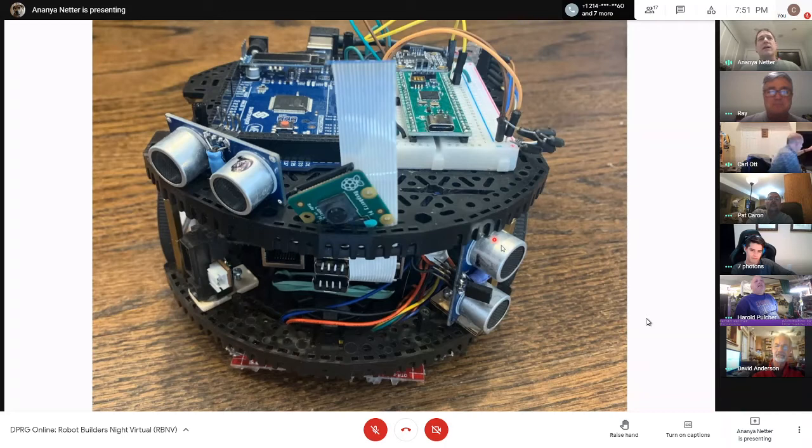So that was one thing. The other thing, as you can see here, is I have a couple of sensors just physically placed as a mockup. I am starting to add some sensors for obstacle avoidance, and that's one of the reasons why I need my coprocessor, so I have more I/O. I'm playing around with positioning of different things. As you can see, those ultrasonic sensors are bulky. The Romi platform is not that big, so it's starting to get tight here, right? You can see a bunch of wires here from my QTR line array going up into the Romi controller. And I'm not using the thinnest of wires, so it's getting crowded. I'm experimenting with different physical positioning.